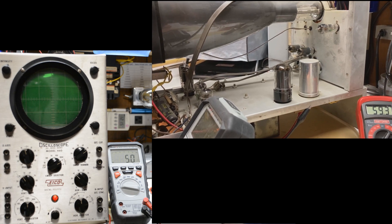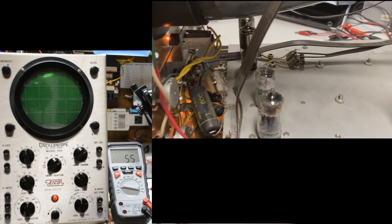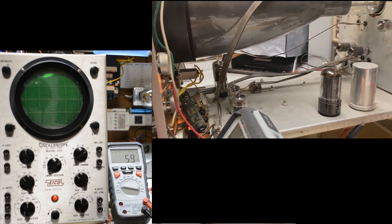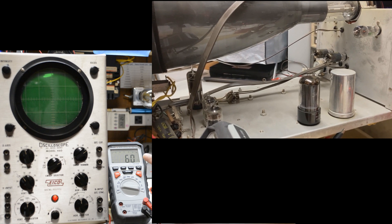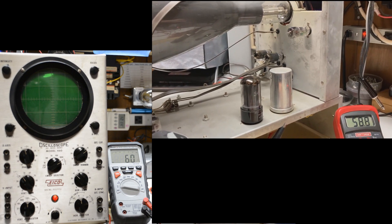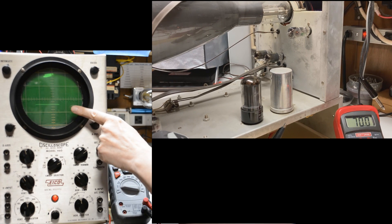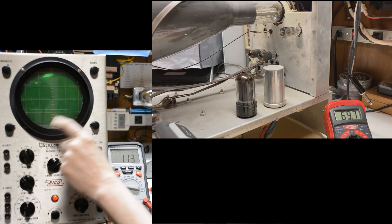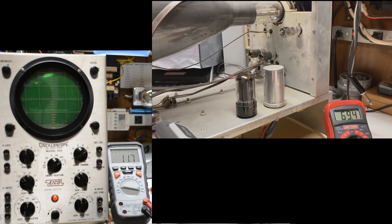At 70 volts AC and 101 volts B-plus, we have a trace — and it's a nice one! It's not bright yet, but we can expect that at this voltage level. It's in focus, which is good. That tells us we've got high voltage to the CRT and we've got focus voltage — otherwise we'd have just a blur on the screen. Everything's looking good so far. Yes sir, Ico's putting up a good fight!